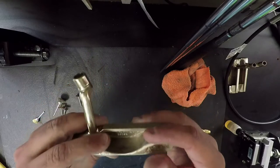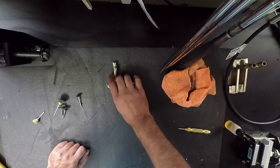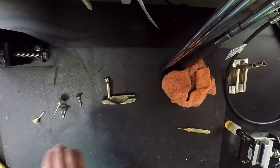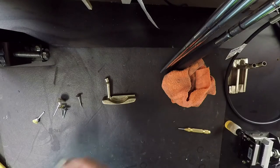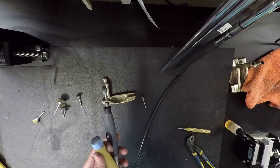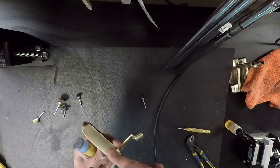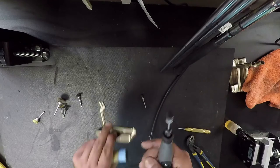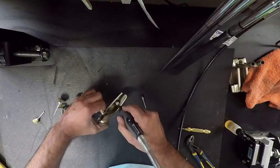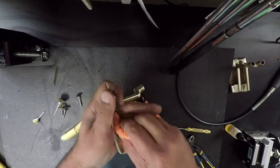The last step is putting this on the polishing wheel to polish out what the 3M pad left behind. Since the polishing wheel won't get into every area, I'll also use the Dremel with some compound. I like using the blue compound — you can use black or white; black is a little more aggressive. Right now we're not trying to take out any deep marks or etches, so a simple blue compound will be fine. Give it a little look — pretty dang good.